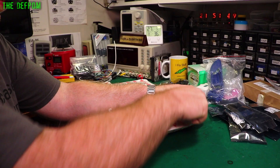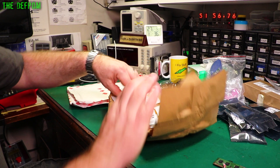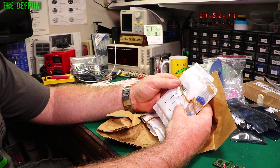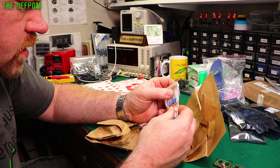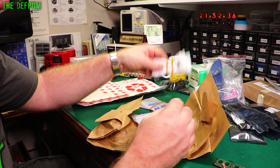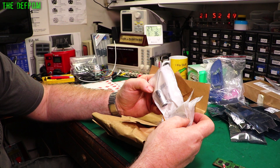What are these? Capacitors. 1085462 — I'm waiting for caps to do the Datrons. These are 10 microfarad, 63 volt. These ones here — 25 volt, 47 microfarad. I've got some other ones from Element 14 as well: 1000 microfarad, 25 volt — some more of those. All axial caps. These ones are pretty chunky — these are Kemet ones, which are high quality. These are actually quite cheap — I was surprised by the price. I think they may be clearing them out, but Kemet ones are usually pretty good.